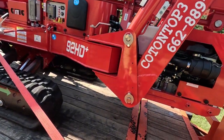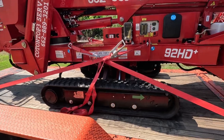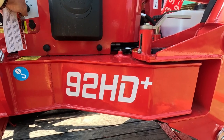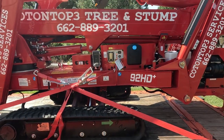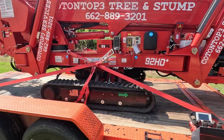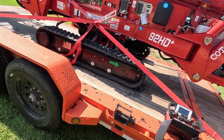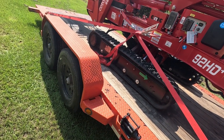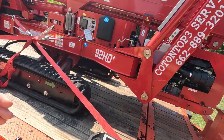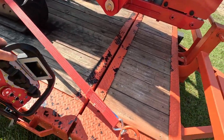The 10-ply tires are fine if you're just going to haul a tractor or use it as a car hauler, but not for this machine, because this thing weighs 9,200 pounds. You're still under the axle capacity with the weight of the trailer combined — it's a 14,000-pound capacity trailer — so we're good, but the 14-plies are the right call. About to unload it now.